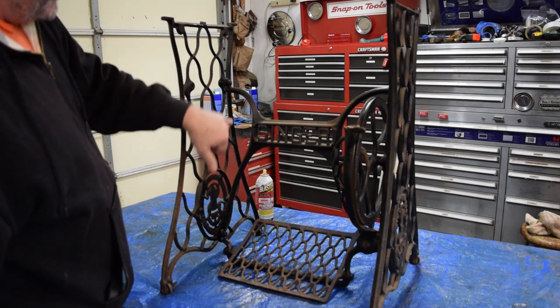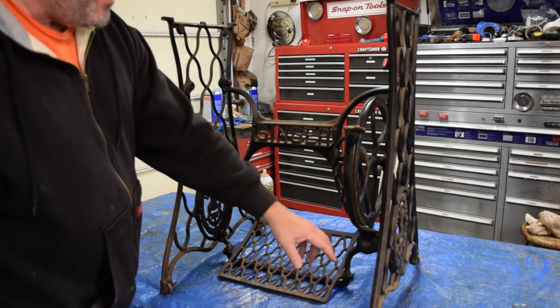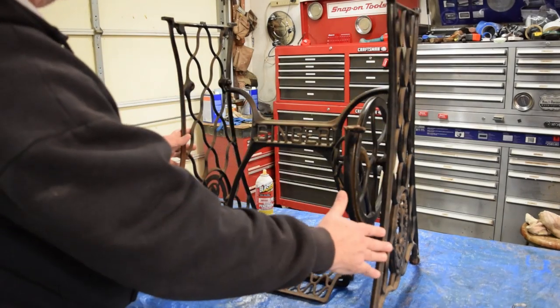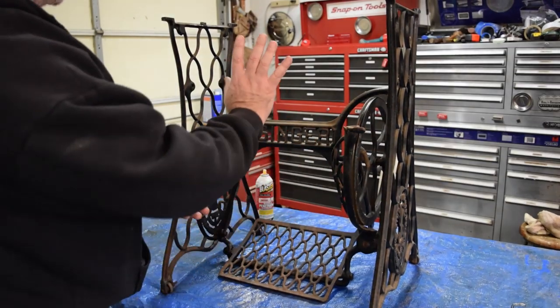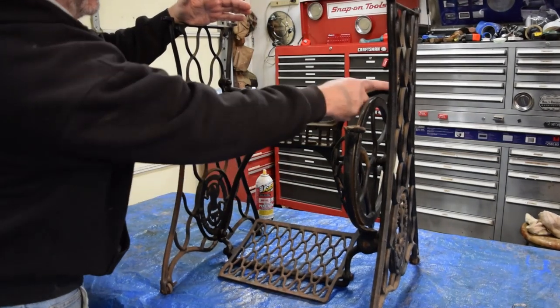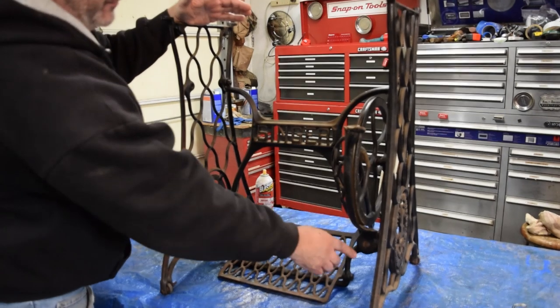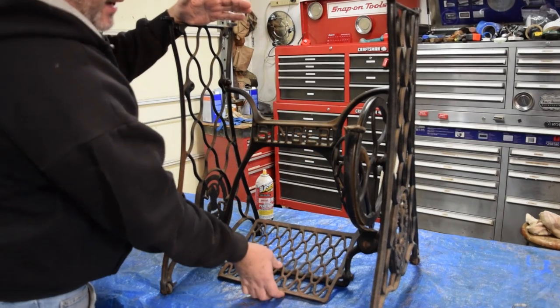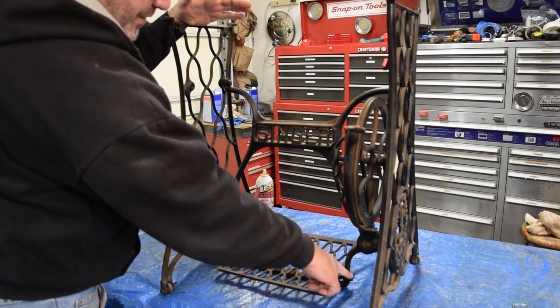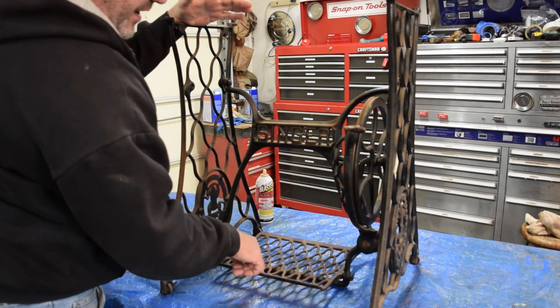So what we've got to do is get these four nuts off, and that'll allow us to take these side pieces out, and then the treadle assembly frame will come loose. It's basically this, I call it an X brace. It's the part that says Singer, and attached to it is this foot plate, which pivots on these two pins here.